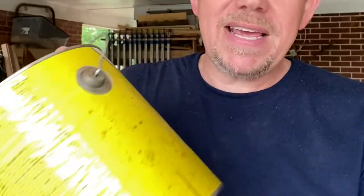A pretty definitive answer to the question — can I just shake my stain or do I have to stir it? I think that answers the question pretty boldly. You should definitely stir your stain every time you use it, because those sediments do sink down and they get compacted at the bottom of the can. When you have a big can like this gallon can, it's even worse. You're not really getting the full color complement of the stain as it was intended to be.